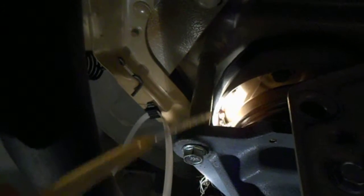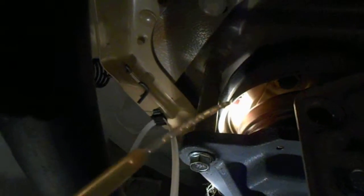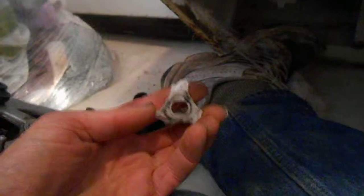This is the brake. That's the brake shoe right there. You want to get the oil in between the outer bell and the brake, and that'll stop it from grabbing. What breaks this coupler is the brake grabs too quick and just snaps that off.